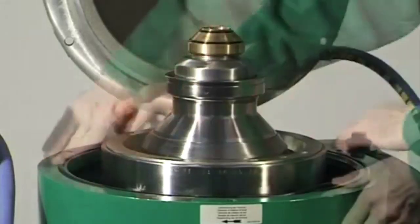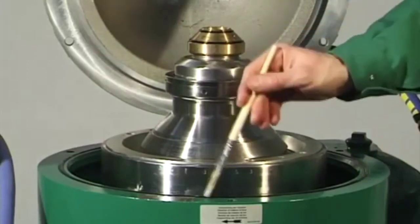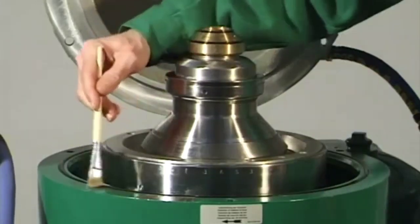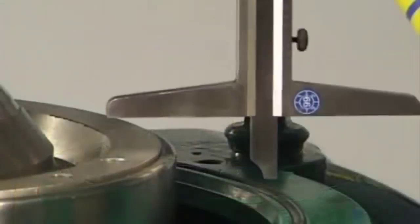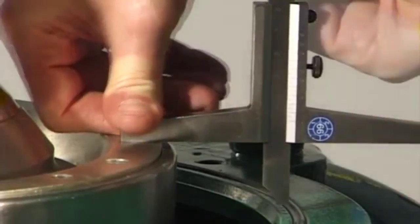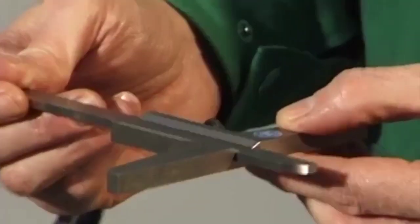Take special care when adjusting the height of the bowl and centripetal pump for reasons of operating safety. The bowl height must not be adjusted on this separator. The bowl height may only be measured with fitted drive belt. The control dimension has a tolerance of 27 plus or minus 2 millimeters between the upper edge of the bowl lock ring and the upper section of the frame.